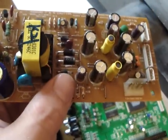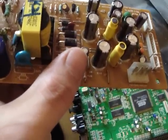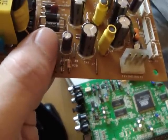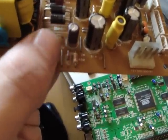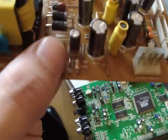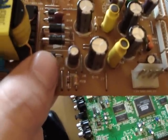There are also some diodes here. If you notice the bottom on the circuit board, this has an arrow and a line. Diodes are basically like a valve — they allow current to flow one direction, but current can't flow backwards. They'll have a cathode and anode side, and they'll have either a gray, white, or black stripe to indicate the direction the diode is supposed to go. If you wind up reversing these diodes and put them in backwards, you might have some big problems — especially if the current goes backwards and winds up burning out something else. Make sure you know the exact rating for these; they can be quite tricky, but you can find the different ratings online as well.